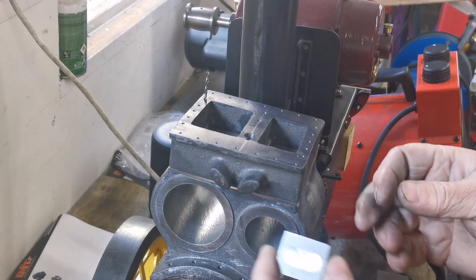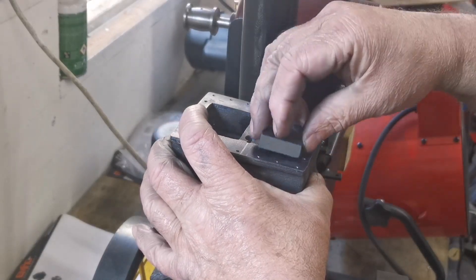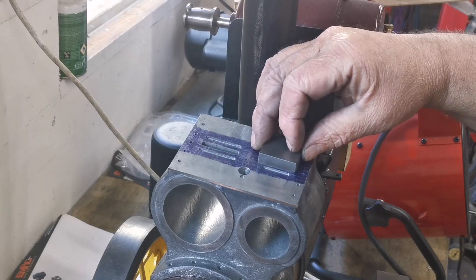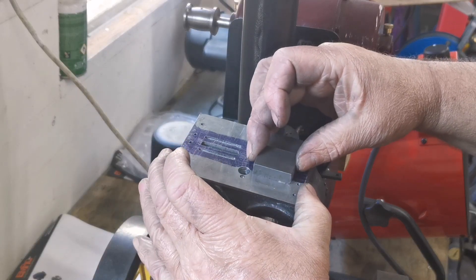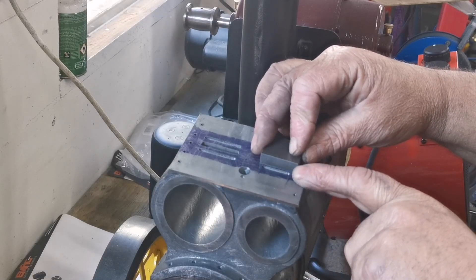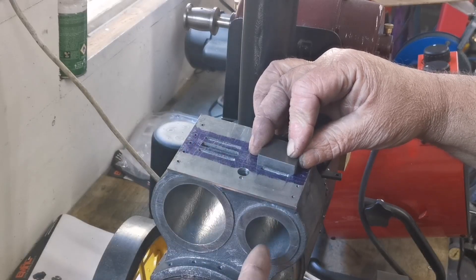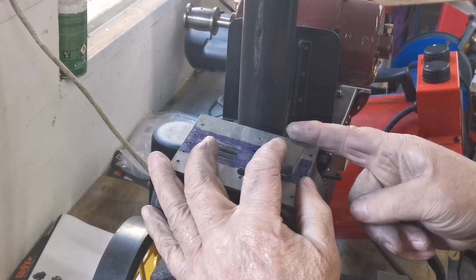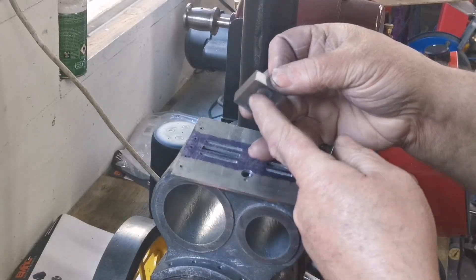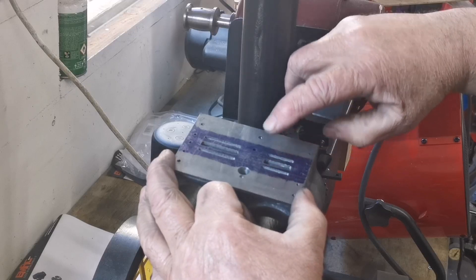I've made a mock-up of a valve — take that off. So the valve is going back and forth with the timing of the piston and the crankshaft. The steam when it's in this chest here will go down through that slot, down through the holes in there, to the end of the piston, pushing the piston to this end. The steam that was in this end will come out of that slot into that channel on the bottom of the valve and over into the exhaust slot.